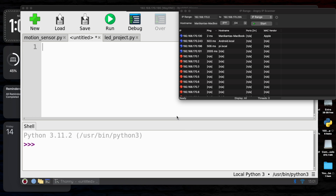I can show you how to build the circuit step by step since I've shown you all the previews and circuit diagrams. If you want to see the circuit again, go back and pause the video there. Before turning on your Raspberry Pi, build your circuit completely, check it twice, then connect the power supply and turn it on. Then follow the same steps: go to Angry IP Scanner, make sure your PC and Raspberry Pi are connected to the same Wi-Fi network, start the IP scan, and you'll get something like pi.local.